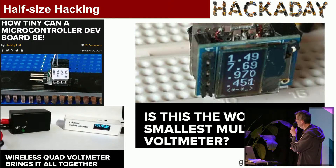I've had a few articles on Hackaday. The first one featured two voltmeters. This is a four-channel wireless voltmeter — the transmitter is actually bigger than the display, which is quite ironic. I also embedded a transmitter into an OBD-2 shell to plug into a car so I could monitor my car battery voltages. This was during COVID, when car batteries were going flat through lack of use.